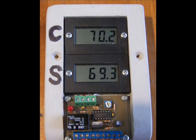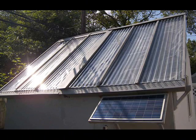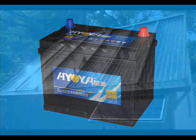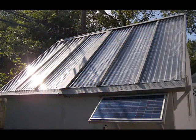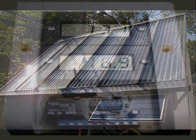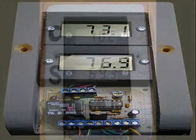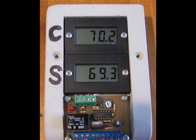The JCDC works great with a 12-volt photovoltaic power supply buffered with a 12-volt car battery. A battery protect circuit is built into the JCDC to shut off the pump in case a problem occurs or the sunlight is insufficient to keep the battery charged. This controller can also be used to power an AC pump, but it has been specially designed to work in harmony with a photovoltaic power supply buffered with a car battery.